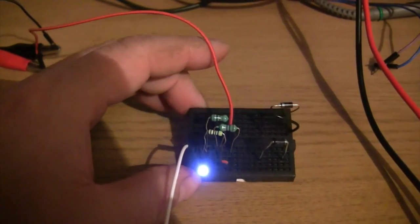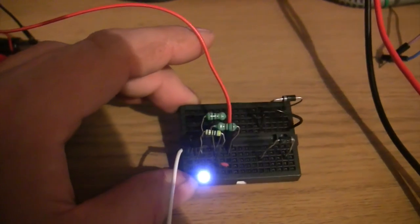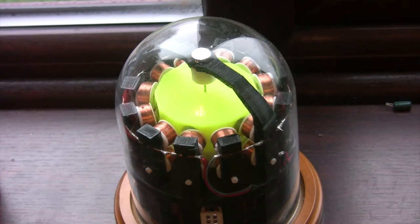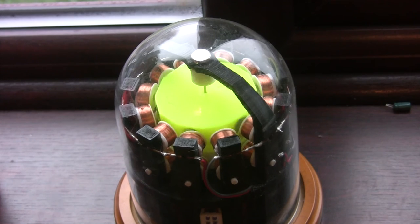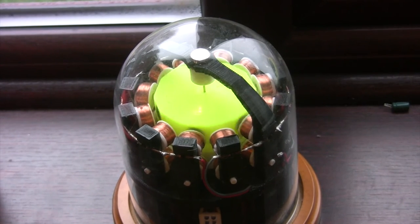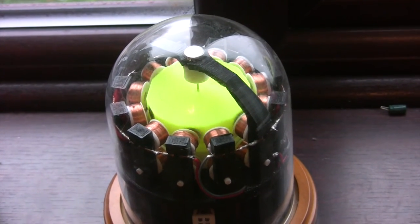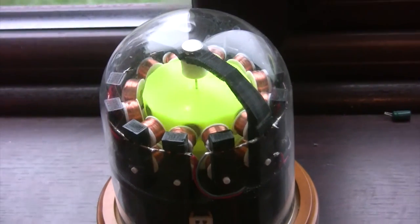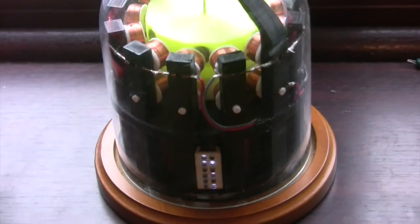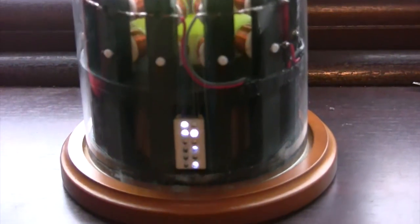I experimented with all sorts of Joule thieves to try to boost the power and do all sorts of things, but honestly, it's not necessary, and they don't last long. Joule thieves work by current, and if you don't have the current — regardless of what voltage you can put out — they simply won't last. Even when the output went through a rectifier and smoothing capacitor, it could light the LED quite brightly, but it wouldn't power a Joule thief to light an LED even brighter, because there simply isn't the current.